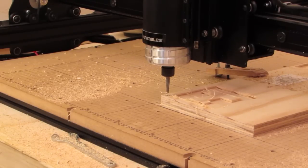Confirm the thickness. Material secure. Detail pass. I'm going to lock my motors. I'm going to raise that up. Let me change this back to 1/10 of an inch step interval so it'll go a little quicker. And we're going to raise that up.